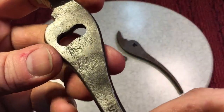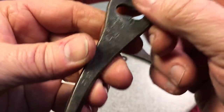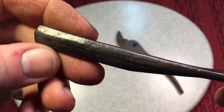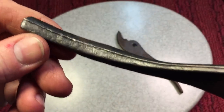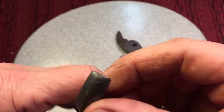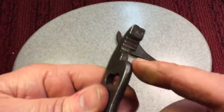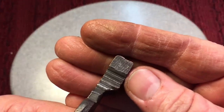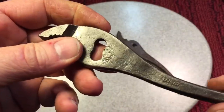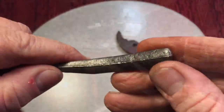Here's our post wire-brush evaluation. No attention was paid to the way these look — you can see we have a little bit of a marking there. Look at that seam mark on this one — they just stamped these out, threw them in a box, assembled them, and threw them out. But the jaws are good. A lot of times these were very good, hard steel — you can tell by the jaws. When you see jaws that are beat up and mushy, that's because the steel wasn't good. We'll start with the flap wheel to take the seams off, then go to the belt sander.